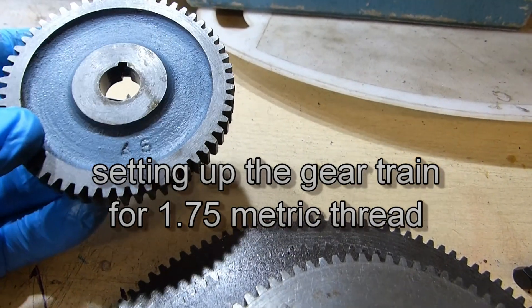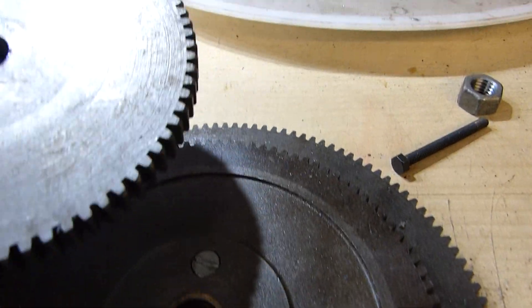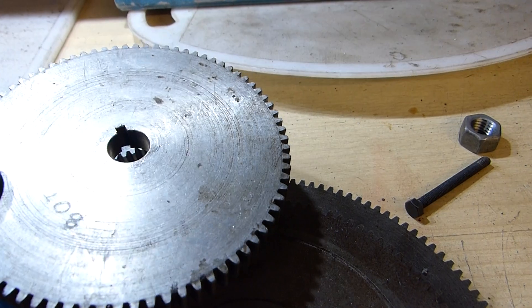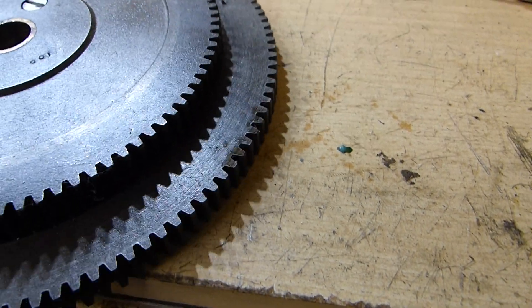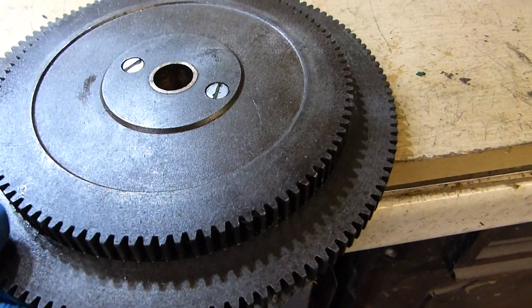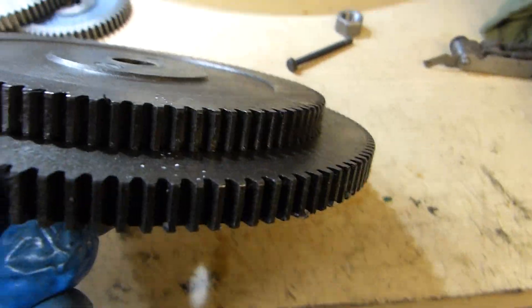Now here are the gears for the metric gear train. This is a 56-tooth gear but for some reason it's been marked 46 at the factory — that crept through inspection and was missed. This is an 80-tooth gear which I was short of; it's made of steel and I machined and cut this gear myself on my milling machine. And this is the 127/100 intermediate wheel from IDG, which I got quite a few years back — it's a really well-made component.